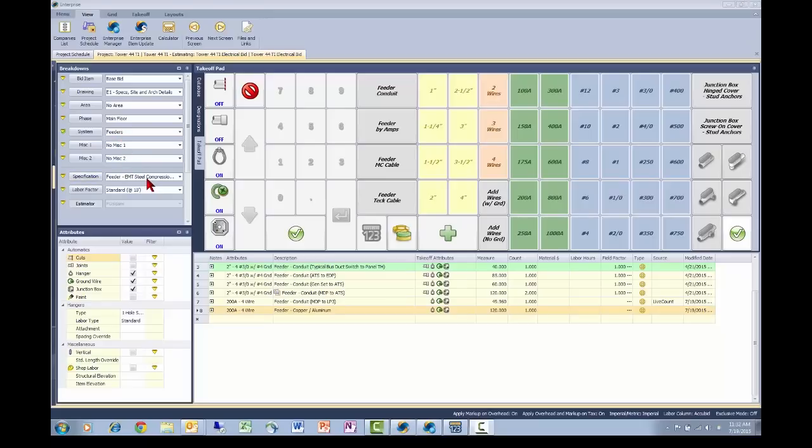We also see down here specifications. By that, for feeders, we mean that we have an EMT steel set screw option. We may be doing EMT steel feeders with compression fittings, and we are going to give an option here for EMT steel compression with aluminum wire, just to give the owner an option that maybe can save a little money. Down below that we have what we call our attributes or automatics.